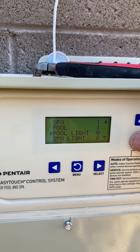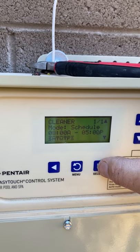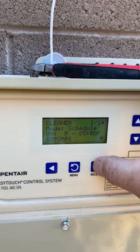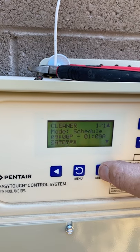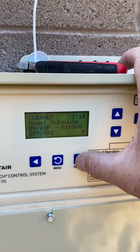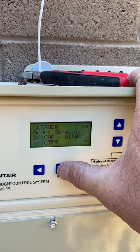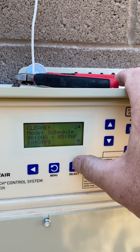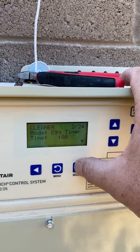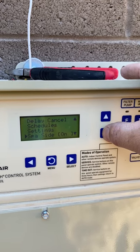You can make more egg timers, but I don't need them here. I go into my Cleaner and I overlap my Pool High and Pool Low schedules intentionally — I want the motor to slow down rather than fully shut off and restart. It will only read the High speed, so it goes from nine to one on High speed while the vacuum moves. Even though it says Low speed is on, it will just slow down to Low speed. You can also set a separate High speed egg timer. I like an egg timer for the cleaner — go back to Schedule, make it an Egg Timer, and set a three-hour egg timer for the vacuum. Every time they turn their vacuum on it automatically shuts off after three hours.